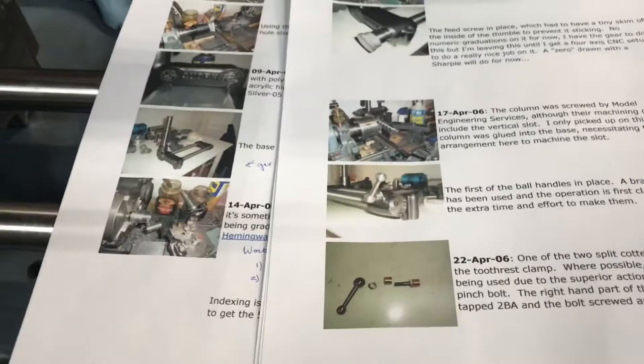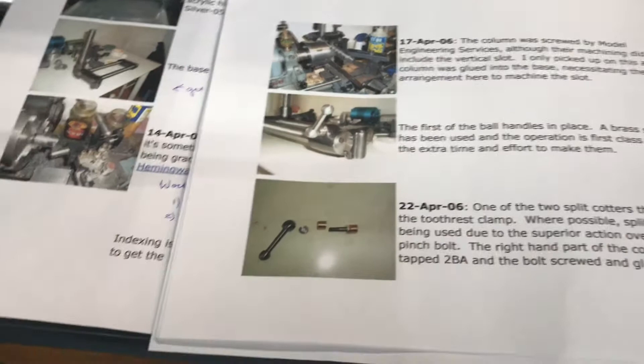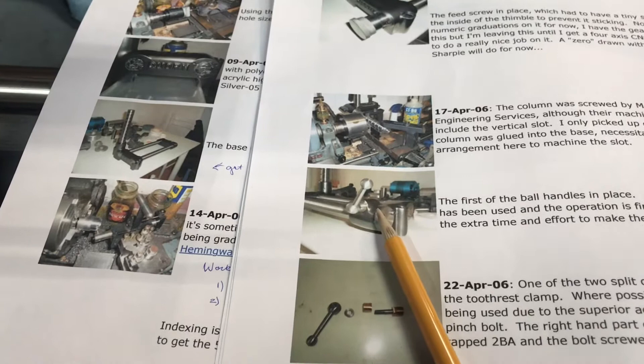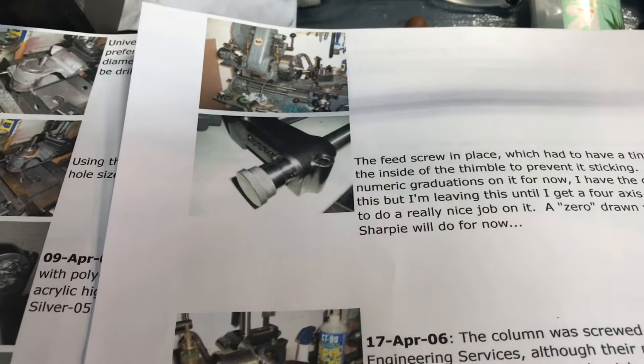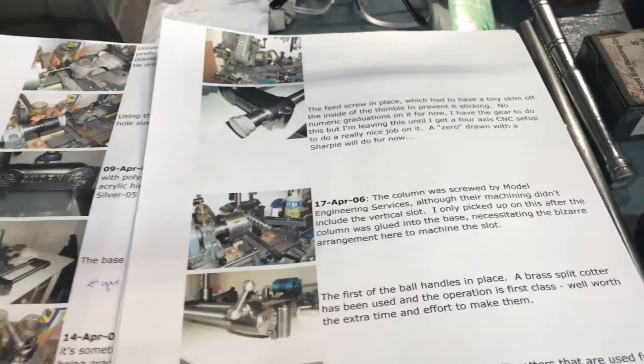Here's the end cap, and these printed pages are from the Duncan Metal Amps website — one of the resources I listed when talking about the project. You can see the little cap on mine; I made a bronze bushing — actually brass — for inside there. I do need to take that out and split it, but I'm not going to worry about that right now. I'm on a roll with the micrometer head, which is essentially this assembly. There are three different parts that get made, and I have a couple of pieces of inch-and-a-half steel which would be just right.